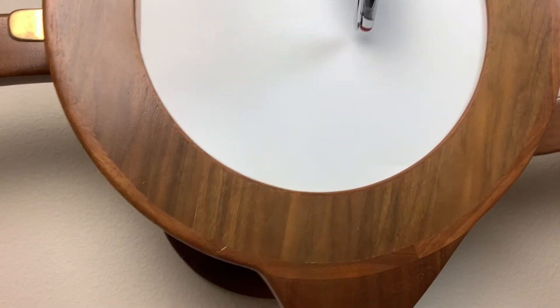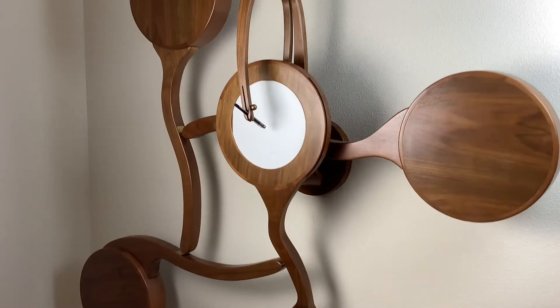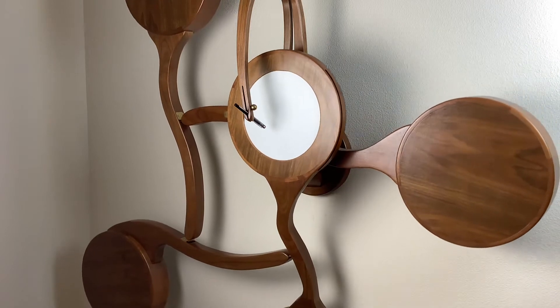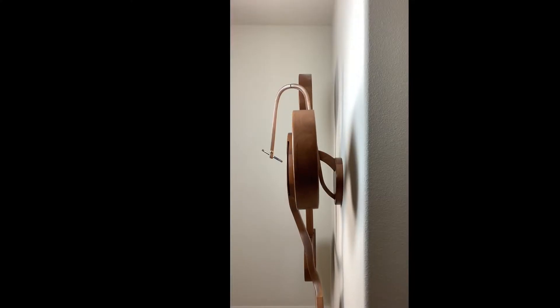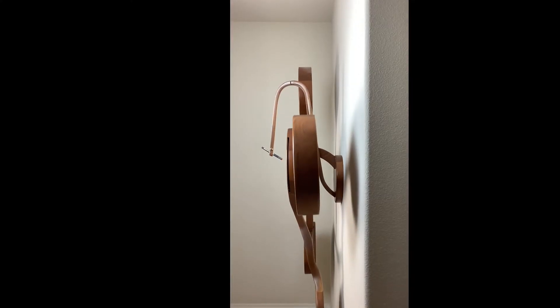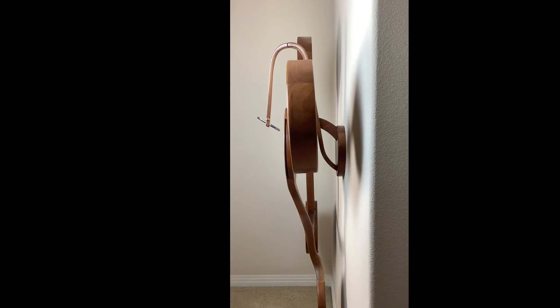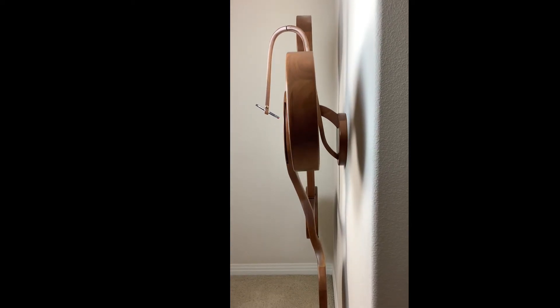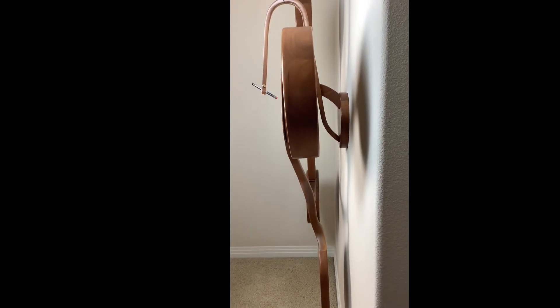At the top of the second horizontal pendulum bar is a fourth weight wheel, 16 inches in diameter and one and three-quarter inches deep. This wheel also has the paper holder and drawing surface. At the bottom of this bar is a fifth weight wheel, the same size as the paper wheel. Each pendulum provides the pivot location for the next pendulum. The movements of each pendulum combine to produce the movement of the drawing surface. Viewed from the side, the first three pendulums move in a plane parallel to the wall about 8 inches away. The second horizontal pendulum bar is slanted so that the drawing surface moves on a plane about 11 inches from the wall, so it clears the pivot of the first vertical pendulum. This slanted bar causes the bottom weight wheel to move in a plane about 5 inches from the wall.